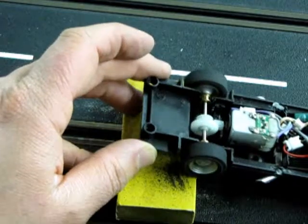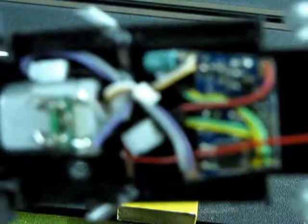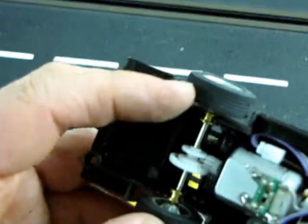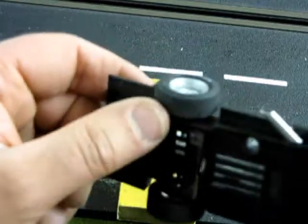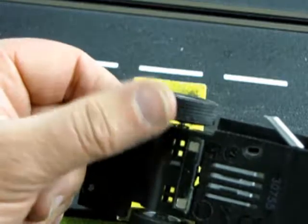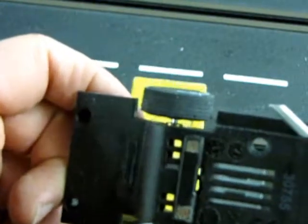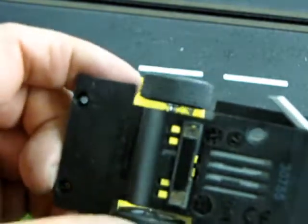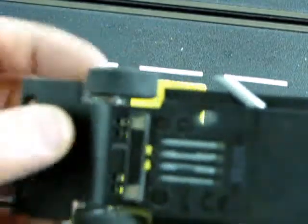They like to fight because there's so much resistance. Okay. Stop torturing the motor. So now you can see what we've done. We've machined this tire surface down so that just like our wheels here, it will be 100% square. Scraped a little bit on the magnet there. Anyway, so that's it, that technique.